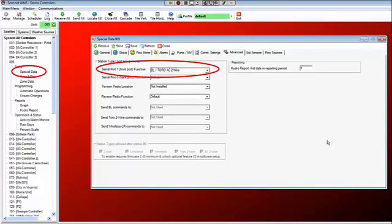Now, if for any reason you need to change ports, say you're hooking up a 900 megahertz radio, you're putting in a modem of some sort to it, and you're using a port and you need to hook up to the front port on your communication device, and you want to reset it to the back. You can move the serial cable up to the back, but you're going to have to change this back port function to be the BL/Toro AC 2-wire. Otherwise, just leave it as it's set from the factory right here, and everything should communicate fine.